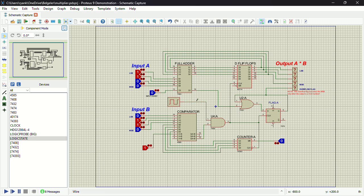When the comparator output equals one, the clock is also connected to this AND gate, so both inputs being one means the output depends on the clock — the clock runs normally. However, when input B becomes less than or equal to the counter output, the comparator output becomes zero, which turns off the clock. When the clock is turned off, there's no enable signal, so the memory and counters stop and the memory won't be updated — that's how we get our output.